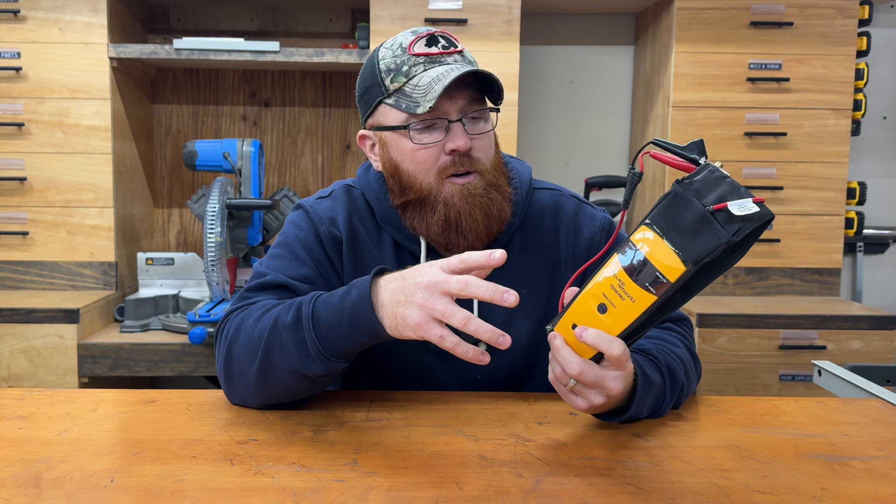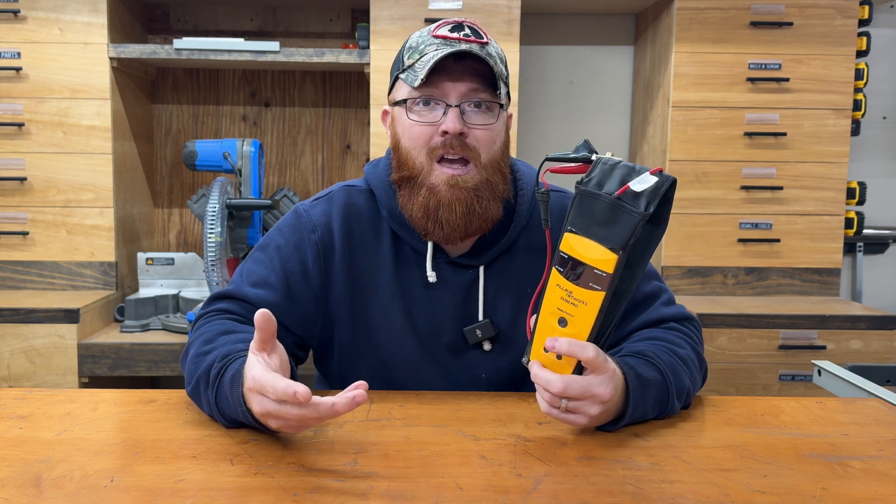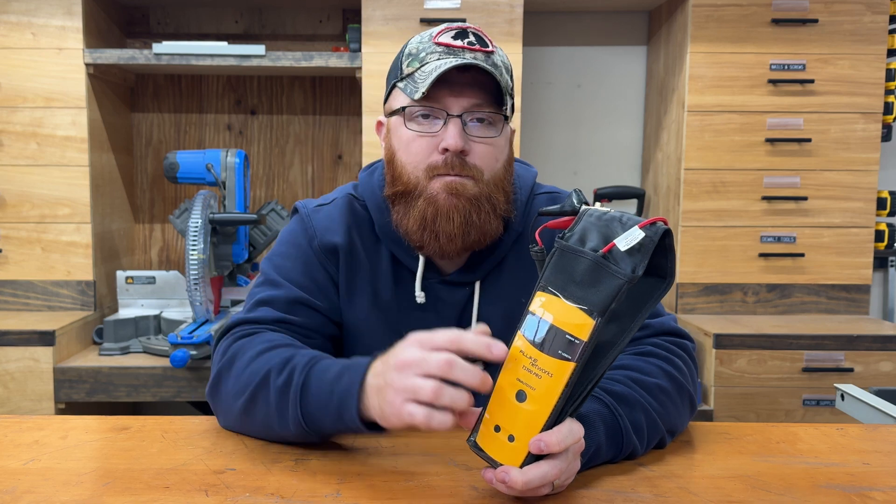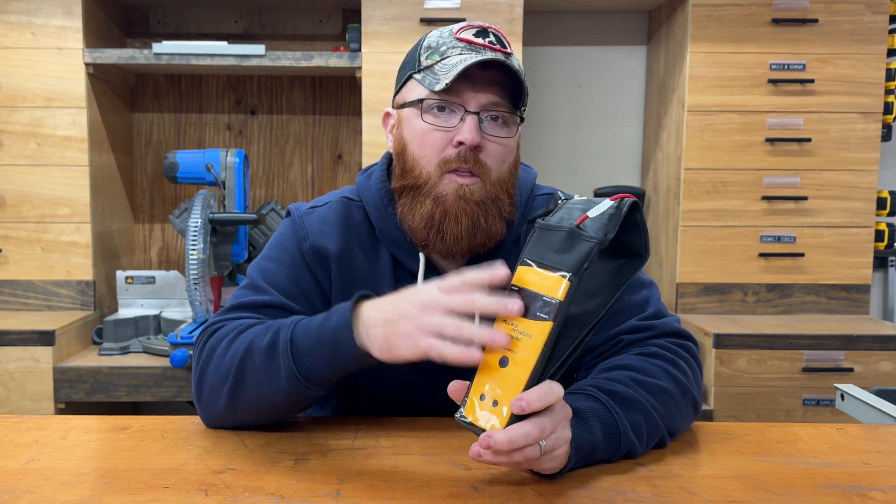When it comes to this meter versus the TS100, here are a couple of differences that make it so great. On the regular TS100, you were limited to 3,000 feet of cable length you could diagnose. On this one, you're able to go up to 8,000 feet, and it also has the ability to pick up bridge taps. In the DSL industry — and yes, most nowadays is going to fiber into the home, copper is kind of becoming a dying breed, but there's still a lot of it out there especially in rural communities — most bridge taps have been taken off lines over the years, but there are still quite a few out there. This is the meter I grab when I suspect a bridge tap. It also has a BT filter mode you can cycle up to, which allows you to skip over the first bridge tap to see if there's a second one in the line. The BT filter lets you filter out that first bridge tap and potentially see a second one. It can sense a bridge tap up to 3,200 feet — so you get 8,000 feet on opens and shorts, and 3,200 feet on bridge taps.